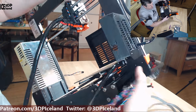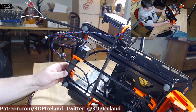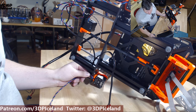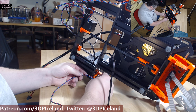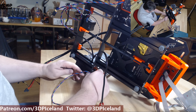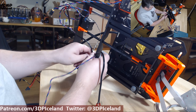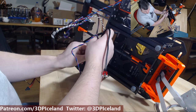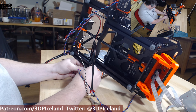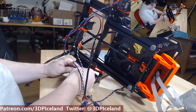The next step is step 14, cable management. You have to turn the printer on the side of the power supply and have it on the table like this. Route the cable for the Z-axis motor. Place a zip tie through the hole in the cover — the hole here. The cable goes in a small groove in the cover as well. Just be careful not to nick the wires when you are doing this. Route the cables from the power supply and the cable from the motor through the two holes — you can push through the plastic wraps so you don't have to put the cable underneath the cover. You can just use zip ties through each hole and then they'll be secured in place.